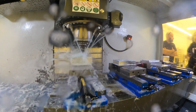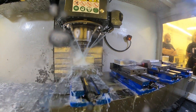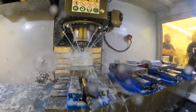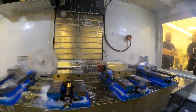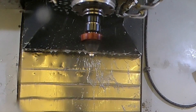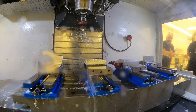The finishes are really important to us, so even though we could run faster on some things, we run the feed rates a little bit slower on some operations just to maintain that appearance - a surface finish smoother than is necessarily required for some other type of part. Now we have a fan that comes in here and blows off the parts, getting the chips and some of the coolant out of the way.